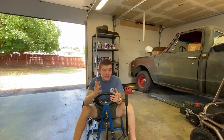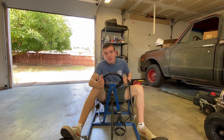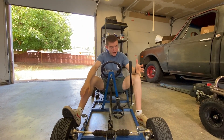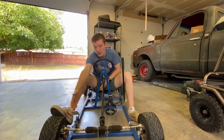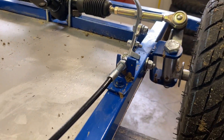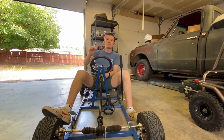You may have noticed we have two pedals, but we also have a brake handle. We originally planned to have two pedals — one for brake and one for gas — but our cable was not long enough. That's something you have to think about. You need a throttle cable that's long enough; measure it out so that it fits to your engine and properly gives you power every time you step on the gas.